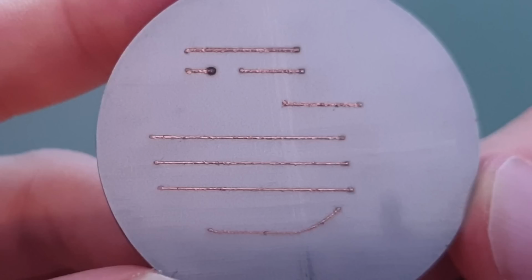You can see from the topmost track that at a layer height somewhat representative of what is typically used, there isn't enough power to form a nice profile, suggesting that this wasn't going to work as I had hoped. I will say that I am surprised at how easily these formed coherent tracks when compared to stainless steel, and how well it bonded to the substrate. But as the Z-axis wouldn't provide the accuracy I needed, I decided to leave this just as another set of tracks.